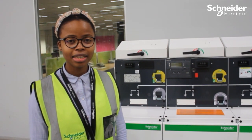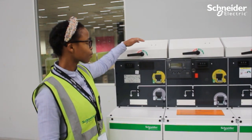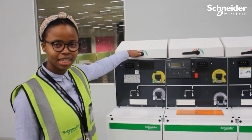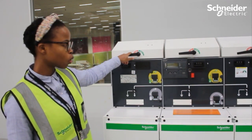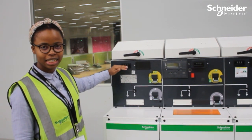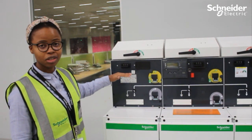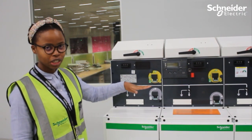What the operator can see — I will demonstrate from the top. This is a cable test facility which has a clear indication of open and close. And if you go down, we've got our VPIS, a voltage presence indicator system, which shows the presence of the voltage in your system. You can find this in all three functions.